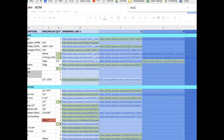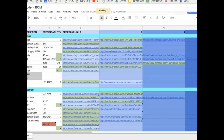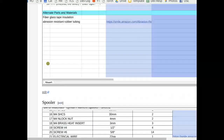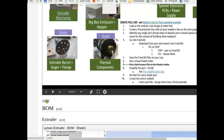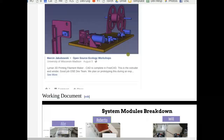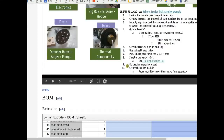Then maybe every once in a while the bridge will collapse and you'll get a flood of plastic in, which can also cause variation - like flour flowing through a chute sometimes doesn't flow evenly. The vibratory conveyor, which is part of the star feeder, helps to move the flake smoothly. The vibrations kind of help fluidize the flakes and help them move nicely.